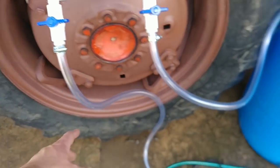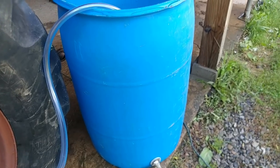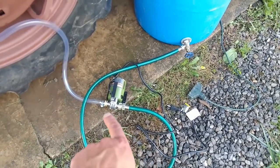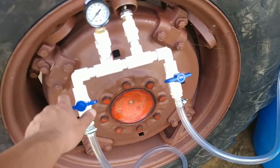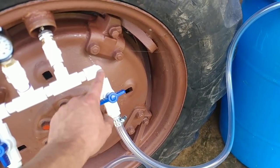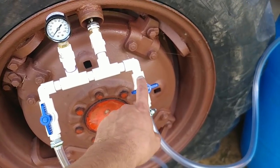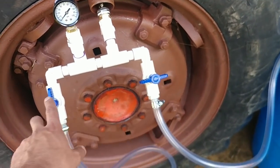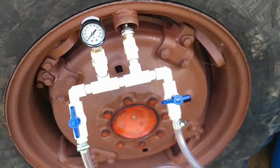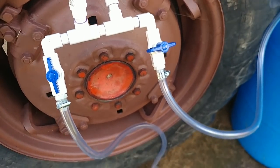The theory is: once I fill this up with windshield washer fluid, I'll probably put 10 gallons in and see how that does. It'll flow through the hose with this valve open, around and into the pump, and the pump will pump it up and into here. This valve will have to be open, and this one here will have to be closed because we need to restrict it — a little bit of fluid will go in, but the majority would go back into the tank, which I don't want. With this gauge I can watch how much PSI is in here and see what the pump is putting out.